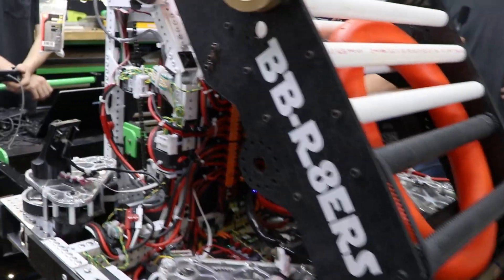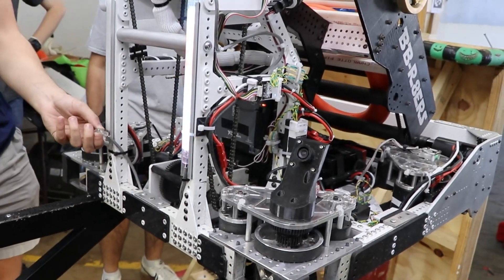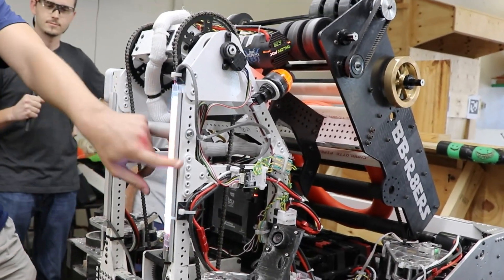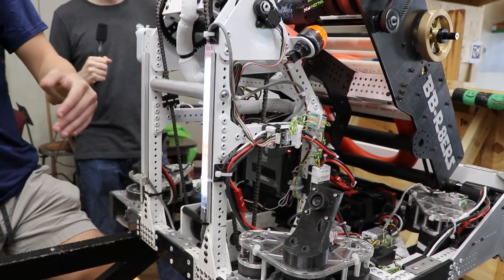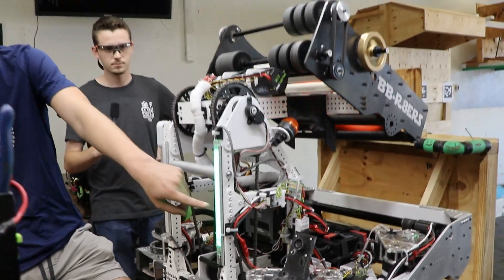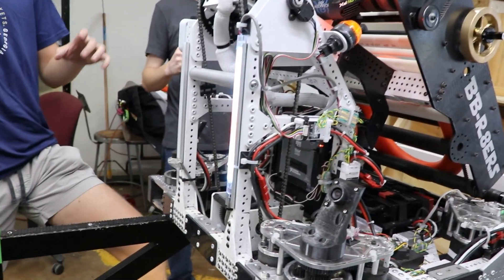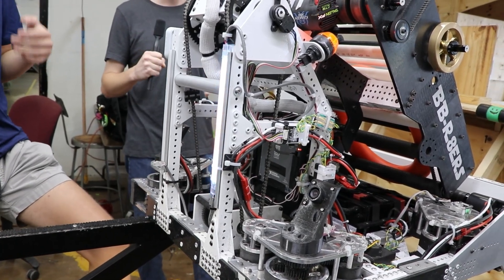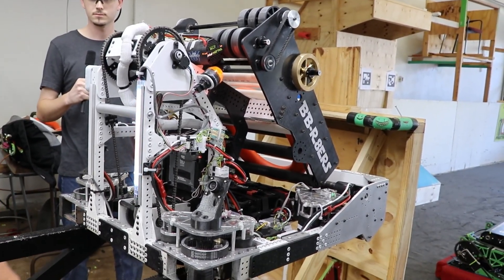One last thing is we have LEDs on our robot. They communicate with the driver — right now we're disabled and we know we're the red alliance. When we have a note, the lights strobe green indicating we have a note. If we go to a set point, it stays solid green to indicate we're ready to shoot. When we have an AprilTag lock, it also indicates to the driver, which is helpful when crossing the field and we may not have the most accurate odometry — letting them know when the robot has converged on its true pose on the field. All of that combined has allowed us to really improve our cycle times and get us where we want to be.